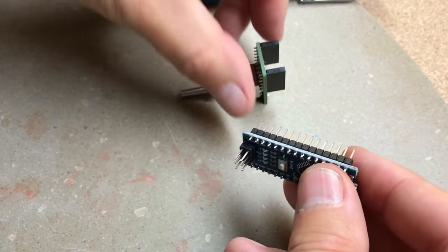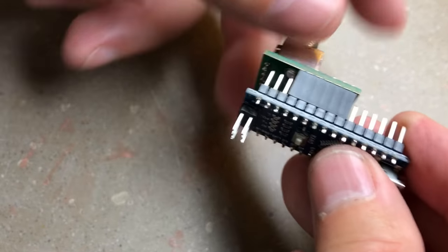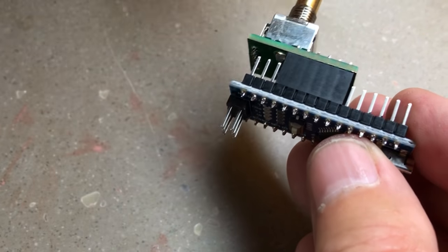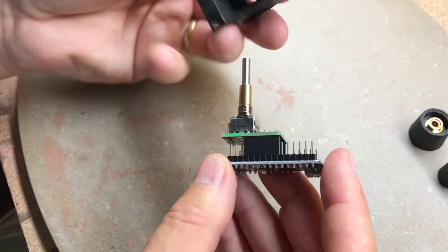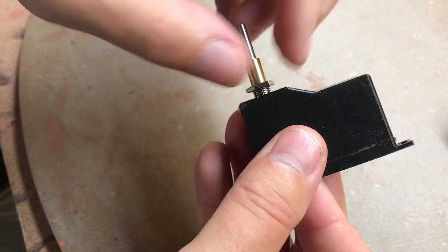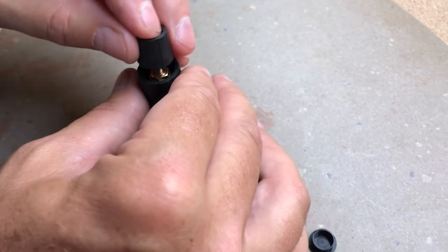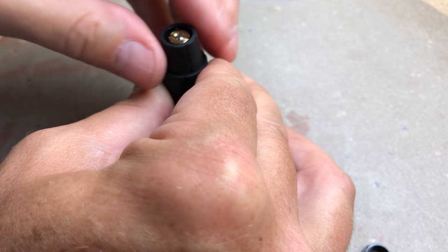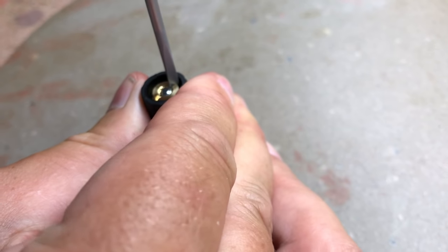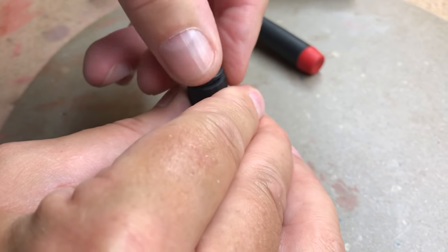When you're done, you're ready to put the unit together. It's just a simple matter of taking the encoder, aligning it with the correct pins, and pushing the pins into the socket. This is the guts of the Knobster here, ready to be installed in the case. The beauty of the modular design is if part of the unit is damaged or becomes inoperative, you can replace it. Then you just slide it into the plastic case, secure it with the nut, install the knobs — they have collets so they are very securely fastened onto the shafts, unlike less expensive units with friction connections. Once secured, it's just a matter of mounting it as you'd like, attaching the cable, and following the directions to set up the unit with Air Manager.